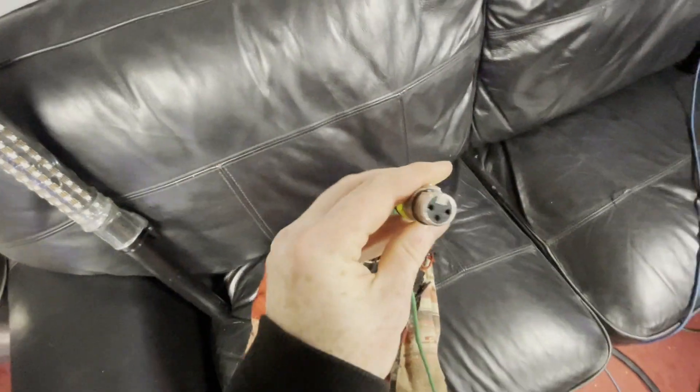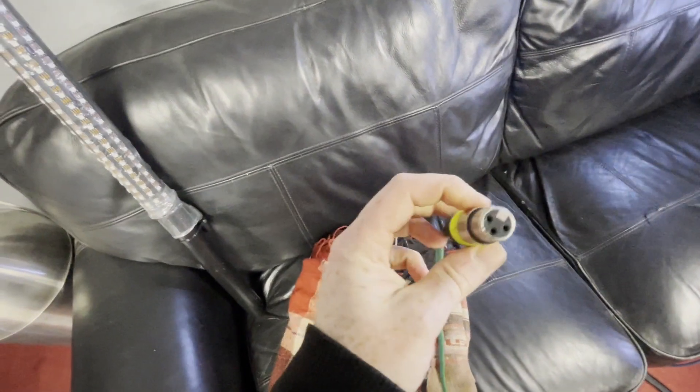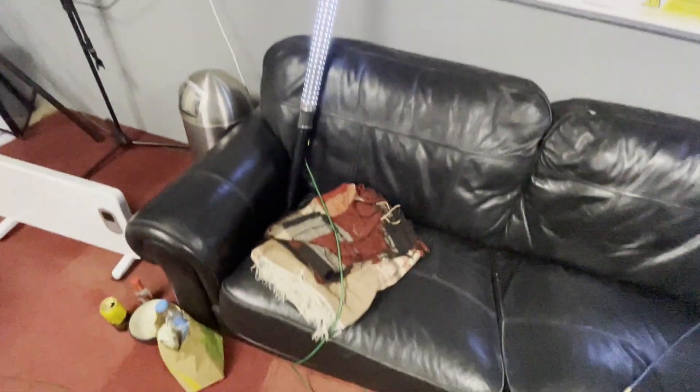They're all designed to run off a single cable each, and that is just standard three-pin XLR. It's not running DMX - this is danger cable. If you plug this into anything else it'll probably blow up because it's got 12 volts coming down it. But as long as you know what you're doing and only plug them into these things, you should be all right.